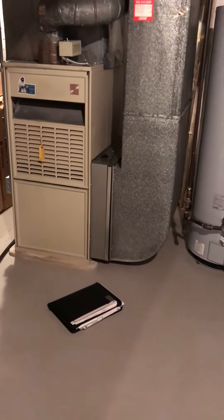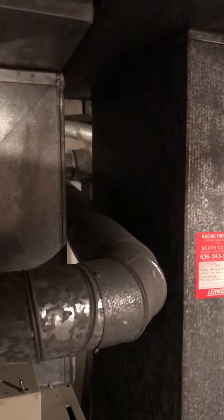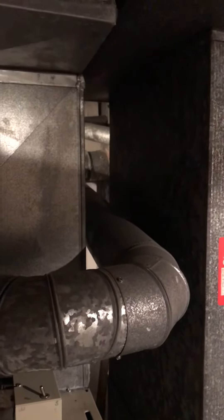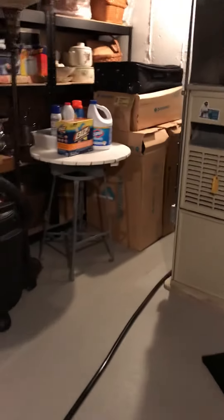When we install, we'll put in a new return drop and a new flue. You'll notice there's a water tank nearby and both flues are running and connecting into a tee at the back — connected to the metal liner dropping down. We'll put in a new vinyl drain and run it to the drain, which is roughly about 10 feet from the furnace.